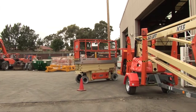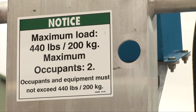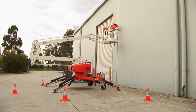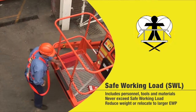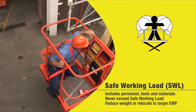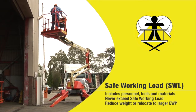The capacity of the EWP is known as its safe working load or SWL, and decals on the trailer lift will clearly display the SWL. The trailer lift, like any EWP, is designed to carry a maximum SWL which is clearly specified. This includes any personnel, tools and materials you may wish to lift. If the weight you need to lift is greater than the SWL of the trailer lift, you will need to use a higher rated EWP or reduce the weight of the load until it is below the SWL.